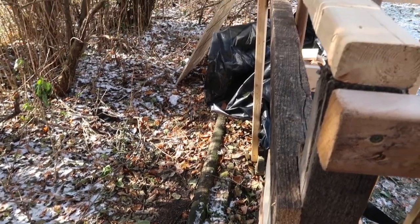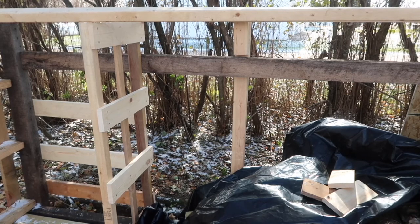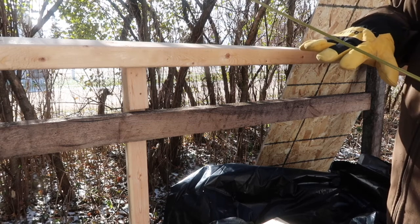I also had to clear out around the back of this because it was all getting grown up in lilac trees. The next thing is to attach the OSB to the top. Typically, wood shed roofs are higher in the front and slope to the back, but because I'll have so much weather coming from the front, I'm going to have it sloping down toward the front. It's not corrugated metal or anything — just a slight slant coming out a little bit. The width is around 16 inches and this piece is 24 inches, so it'll come out a good seven or eight inches.